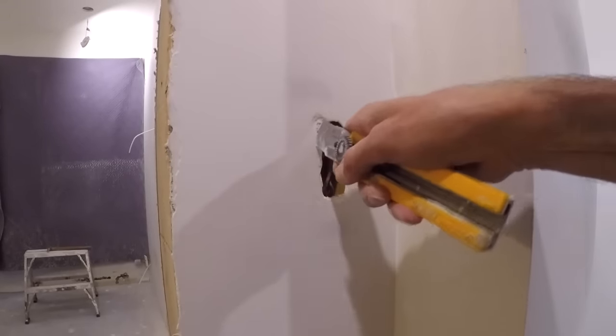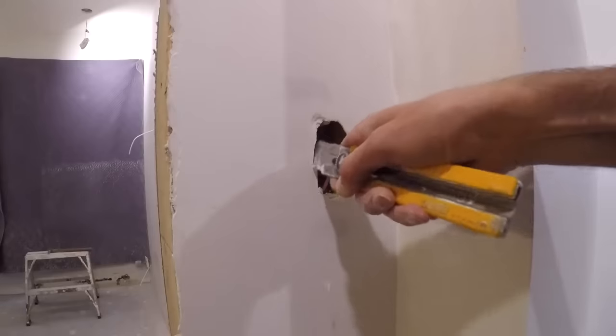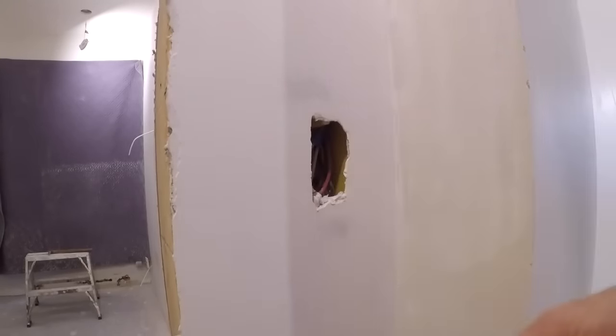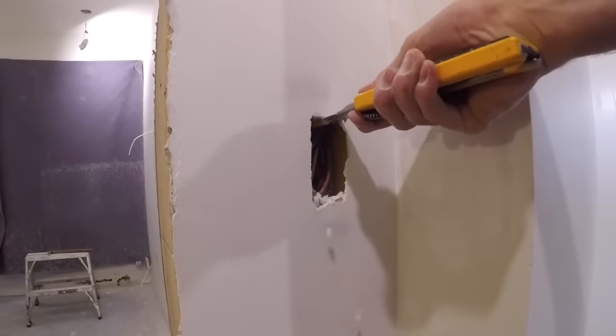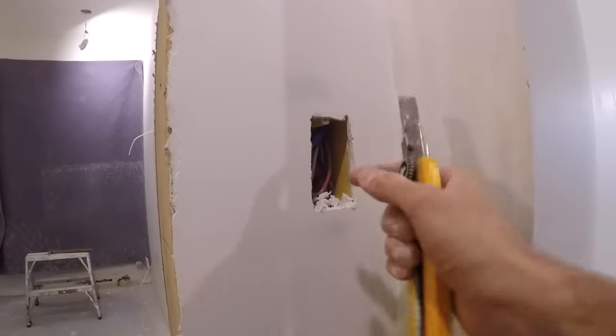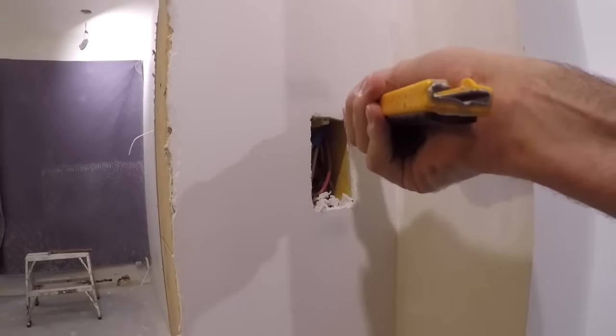Now it's just time to give it a quick sand and detail it with a sponge. You can just carve this stuff out with a knife — make sure you have your power off so you don't go into any live wires by accident. All right, they can get into the screws in both of them, so we're all done. I hope that sheds a little light on how to patch that blown-out or over-cut electrical box. It's a fast, effective, and durable patch when done properly — whether you had a sloppy tradesman in or you decided to hang your drywall yourself, now you know what to do. Thanks for watching Vancouver Carpenter until the next video.